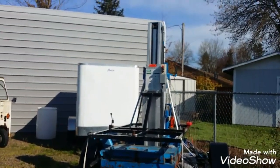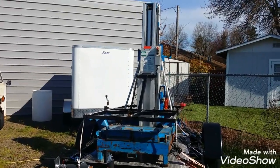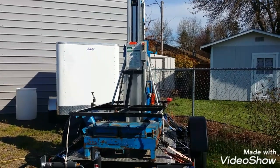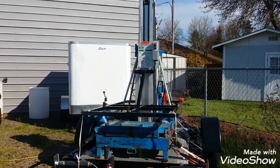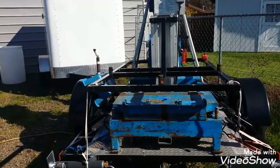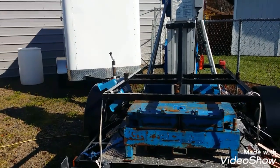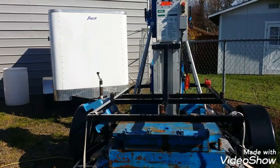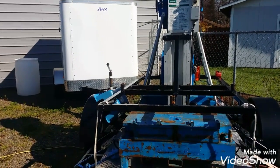Late last year it was fighting me. There are a number of safeties built into this thing that some of them over the years just quit working and they were bypassed, which is really why it was taken out of service. I did some trading for this man lift and then created my speaker tower lift out of it. And then the remaining safeties — there's some sort of a switch on all four corners of this thing, making sure it's real level before it allows it to go up. But despite every effort, I can't get it level enough to go up, or the switches are failing, or something.